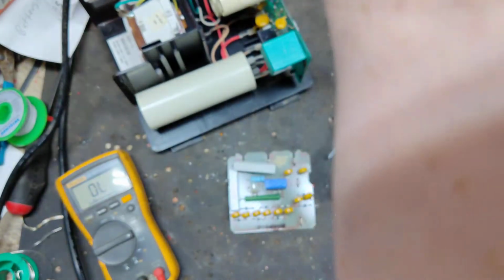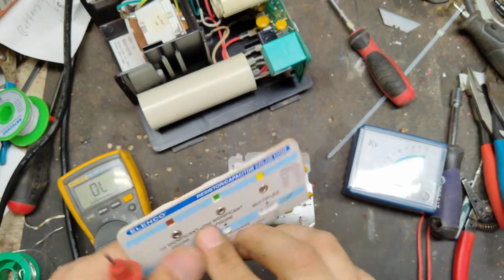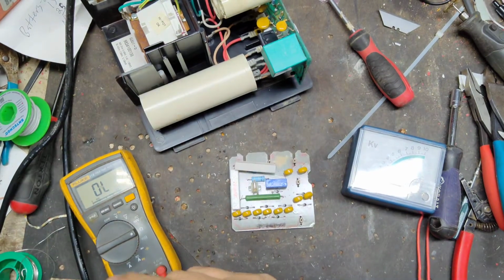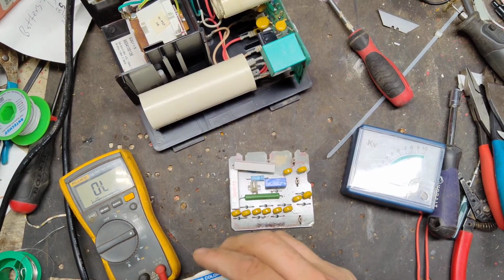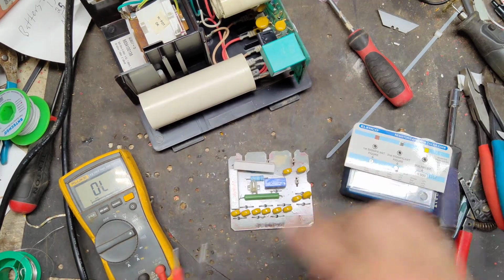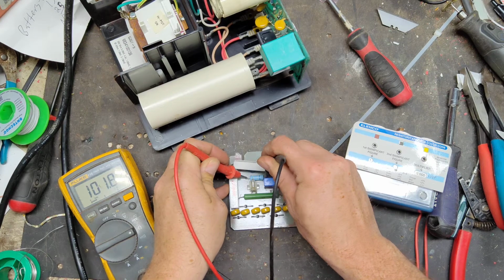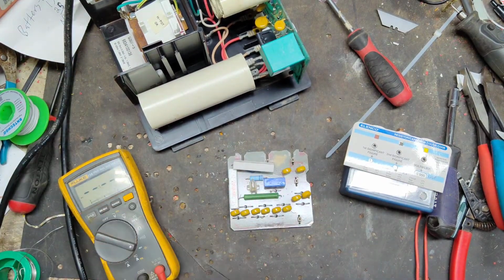Look at that resistor real quick. I don't know what size that is. I can't find my little wheel. Oh, there it is, on my little resistor cheat code thing here. Alright, so it's brown, black, yellow. So it should be 100,000. 100K. So I imagine some of these diodes are probably all bad.